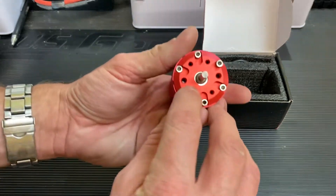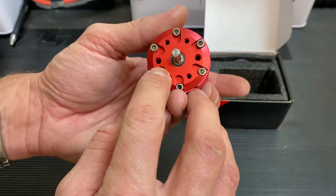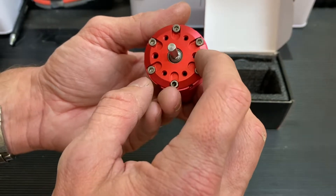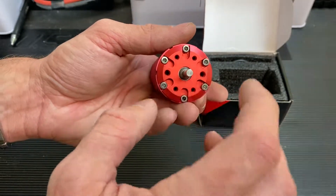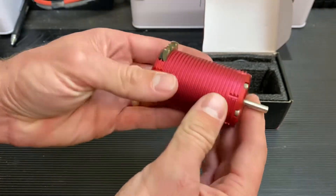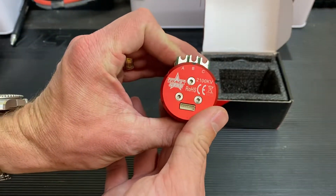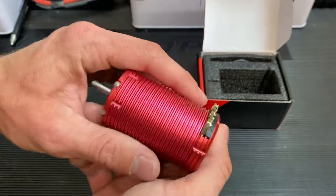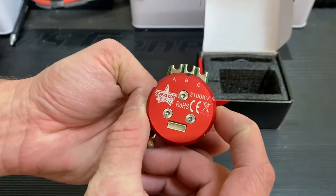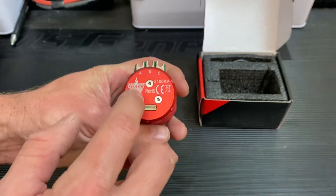You got larger screws if you want to use those — I think it's an M4 or M3, maybe M2 — but you've got your standard motor mount screw holes and you can also use this in a clamping-style motor mount. Here's the rear end of the motor. You've got your solder tabs right there; it's got the old-style PCB going on. They work — and A, B, C of course. You also have screws to release your endbell housing.